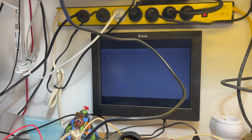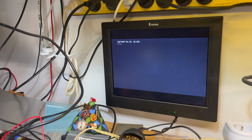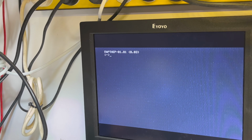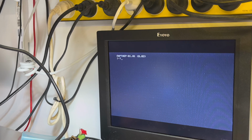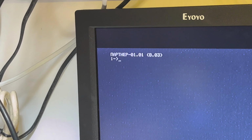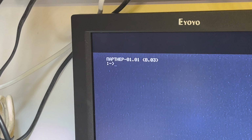And I'll show you the screen. It's just still sitting there waiting. So unless I'm doing something fundamentally wrong, like putting in the wrong file name, let me do it again. So I might knock it on the head soon. The op amp output looks okay, so I don't think I need to swap the op amps out to get it to work. I'm assuming it should show something on the screen when it reads a file header, but it's not seeing anything. So is there an issue with the file header?